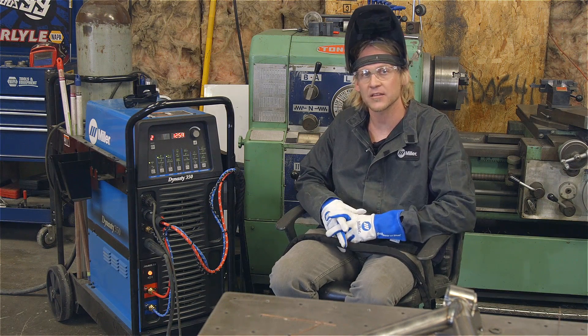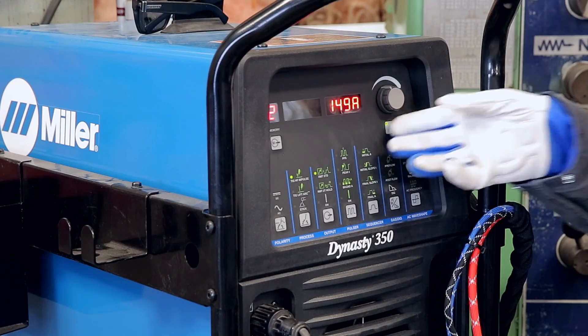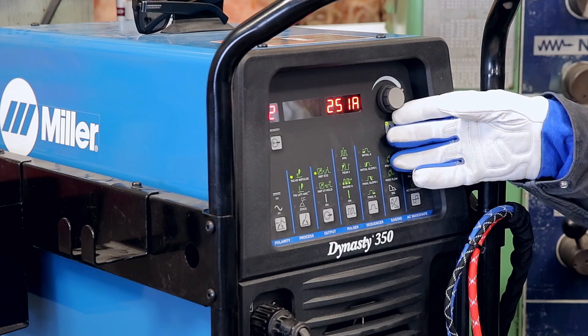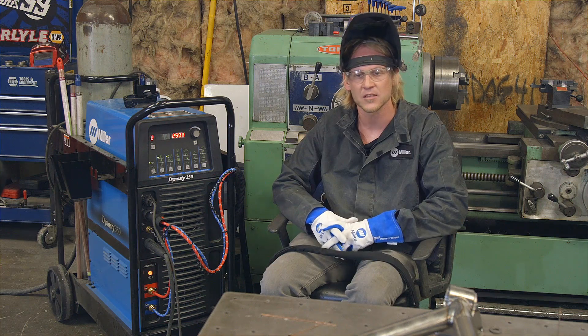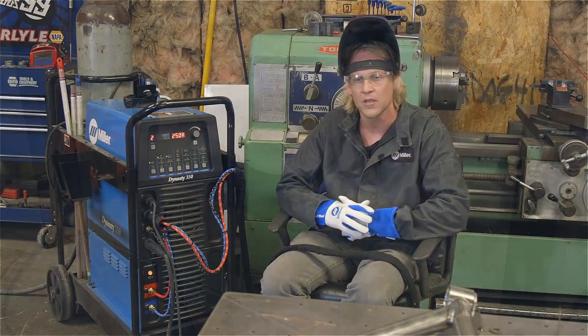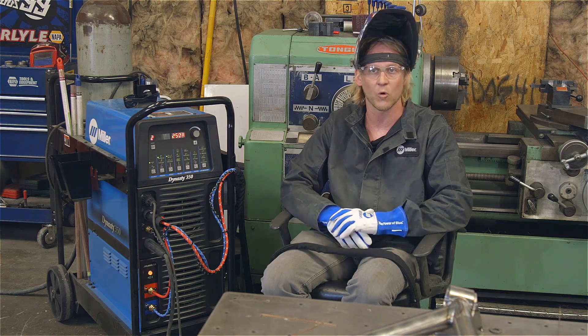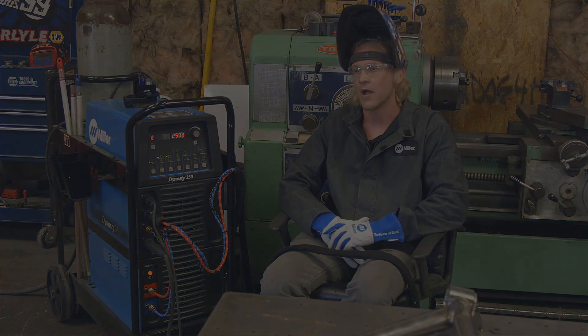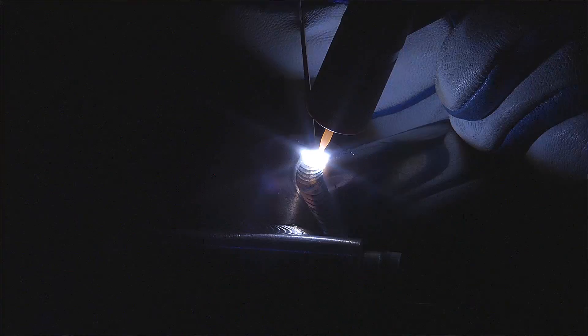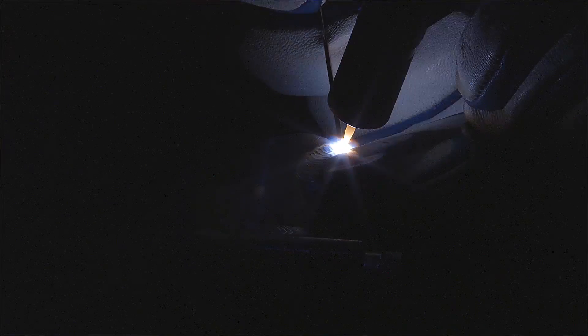As I mentioned before, I like to leave my Dynasty up on 250 amps almost all the time. Typically we weld the root pass between 125 and 175 amps depending on the material thickness we're working with. I like to turn my machine up to 250 amps to weld the cover pass — it has a lot to do with how you get into the pedal and out of it. There's a technique you'll develop and it's just something you'll have to start to feel. Obviously 250 amps is a lot of amperage for 120 thickness material — you're not on the pedal very long. On the pulse pass, there's quite a bit of technique involved, and it's something every welder will have to develop for themselves. You want to roll into the pedal slower, allow the thing to fan out, and then get out of it quick. You'll notice the duration of my pulses is getting a lot shorter as the parent material heats up to its peak.